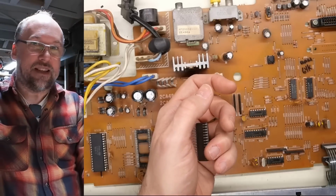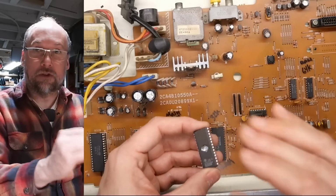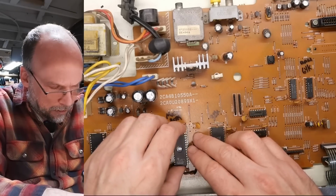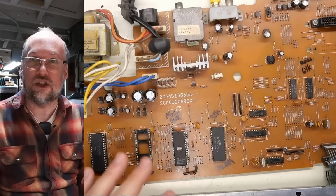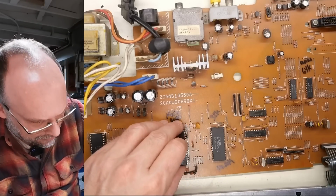I put a copy of the Sanyo ROM in there twice. I just loaded it at 0000 and also at 8000 hex. So that should mean we have two copies of the main ROM. Wherever the main ROM is in the memory map, however it's accessing this chip, hopefully we have a good copy of it, at least in one of the two spots.